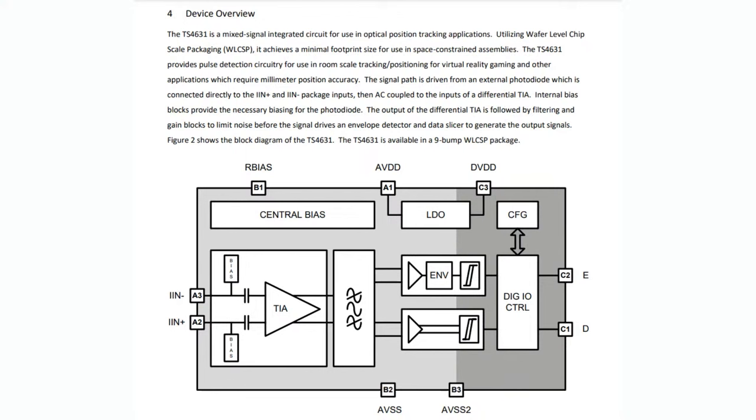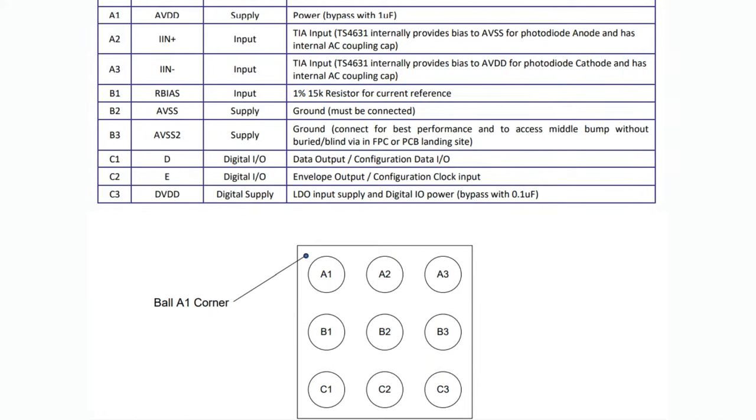Here's how it works. You could build this all with analog electronics, but it would be painful — you'd have to handle gain management, offsets, envelope detection, and data detection. What's nice about the TS4631 is that even with a powerful M33 microcontroller, you still want all the analog stuff handled on this chip, done very small and inexpensively. It's a 0.4mm BGA 9-pin package, and thankfully the middle pin is ground shared with analog ground — so you can use a two-layer board without buried or blind vias, even at 0.4mm pitch. Getting that middle pin out is usually the issue, but they made it really easy to integrate.